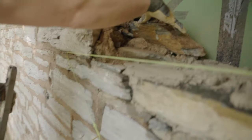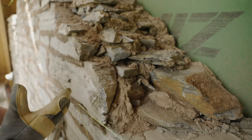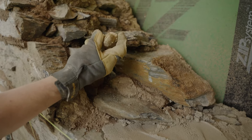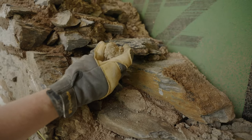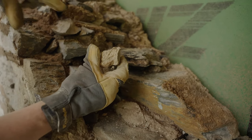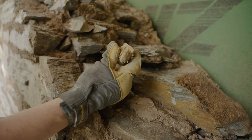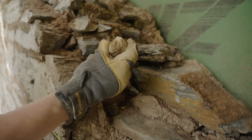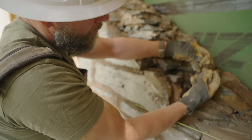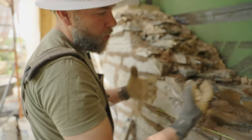The backer course of the wall is right here — the backer wythe and the front wythe of stone, and then the rubble fill. What type of mortar did they use back in 1820? Well, this is it. You can see it has a little bit of animal hair in there — maybe pig hair or horse hair. It's really a clay or dirt that they would have gotten up out of the ground. You can see there's a little bit of lime in there from a lime kiln — that's the white specks. This does not have a very high compressive strength; essentially it's dirt, and the lime helps it take a set. I can break it right apart, but we're not looking for PSI strength in the mortar — we're looking for something that can just hold the wall together cohesively.